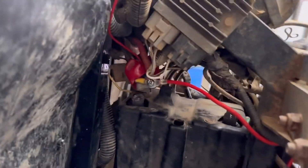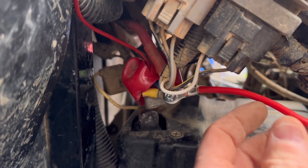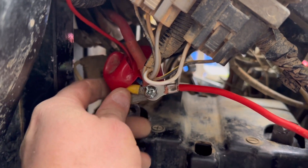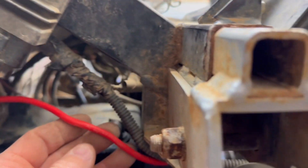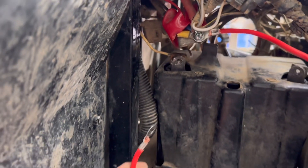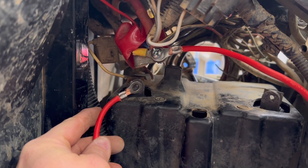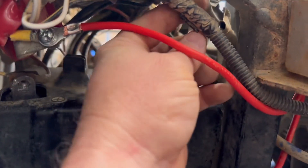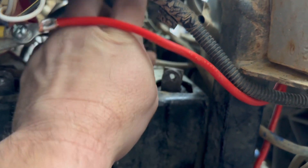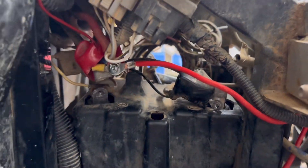So we've got our primary vehicle positive cable hooked up to the Perko switch — it goes around up to there. Got all my other accessories installed; I'm going to tuck that out of the way with a zip tie. Now we have the other end of the Perko switch going to connect to the positive terminal of the battery, and I'm going to hook the negative up. There it is on that side and we'll be in business.